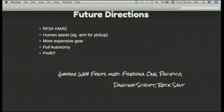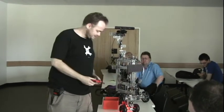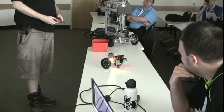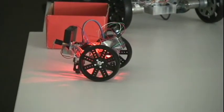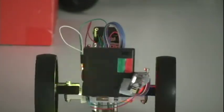This guy might actually work on the desk. This is what you do when you want to make a joystick and you don't want to pay a lot of money: a $4 joystick from China, a $9 UNO clone, radio chip there, and basically just solder headers directly on. I've made the two LEDs respond: red is when that side wheel is not moving at all, and yellow or purple is full steam ahead. On the very face here, alternating between smiley face and various other text, is a $5 OLED screen — fairly low resolution, but for $5 it doesn't really matter if it's monochrome and low resolution.